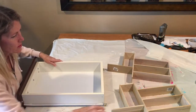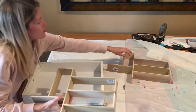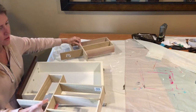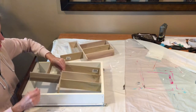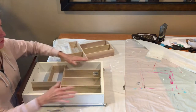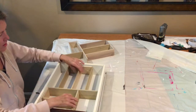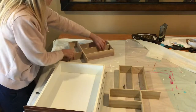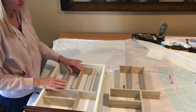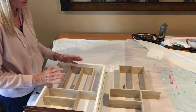I already took the pieces and glued them together. I have two drawers that are exactly the same size, so I had both cut the same — it was really simple to do two at the same time. When I was gluing, I had the pieces dry fit in the drawer so that when you're fitting the pieces you make sure it fits exactly. When letting the pieces dry, I leave them in the drawer so they won't get crooked.